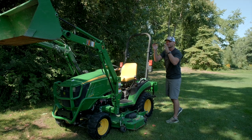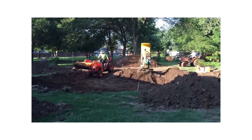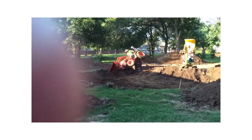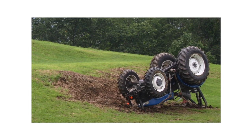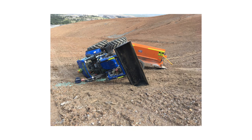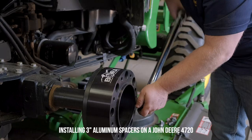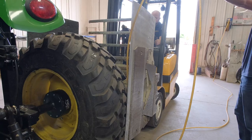The other danger is tipping your tractor over to the side. These tractors are so long and narrow that if you have a loader up in the air — or even a couple of feet down from there — or you're on some kind of incline and hit a bump or a rut, it's easy to get in a dangerous spot. We work with Bora Wheel Spacers because they can widen the footprint of your tractor, especially on the rear axle, adding four, five, six, maybe even 12 inches with six-inch spacers. That makes a huge difference in stability. There are other considerations when getting wheel spacers, which we've covered in depth, but it's a great solution if you're in a tippy scenario on your property.